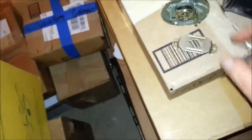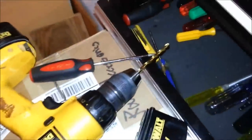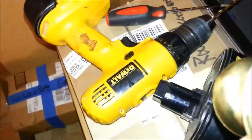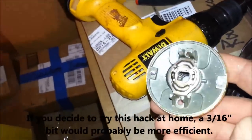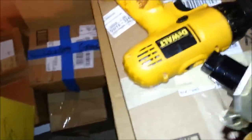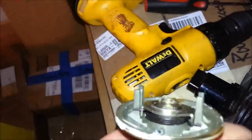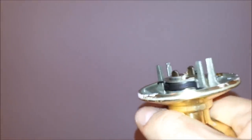And we're back. This is Alex again. I have milled off — with my beautiful high-speed steel quarter-inch drill bit — the rivets on this godforsaken handle, and removed this piece of metal from there, which engages with these little locking dogs, which you can see better now. See them popping out? There we go. Very impressive.